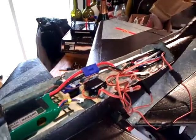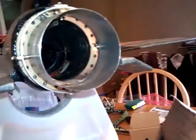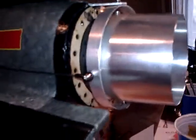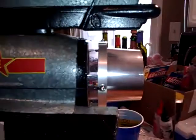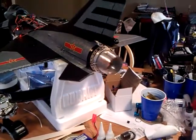I'm going to go ahead and get all these wires cleaned up, make it look all nice and pretty, get the hatch back on, then flip her over and start on the servos and the control surfaces. From there, I'm going to get in here with some acrylic and that clear thrust tube — you can see it in between the thrust vector and the back of the jet. It's actually increased my thrust. I'm going to go ahead and paint that black, as well as the ring around here. That way it'll look like it goes straight black to the brushed aluminum. We should call it good after that. We'll have some more videos coming — hopefully the next one will have everything working, including the afterburner lights. You guys got any questions, leave me a comment and I'll try and get some more videos coming to you.